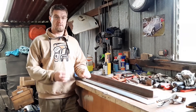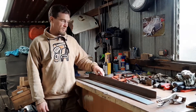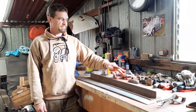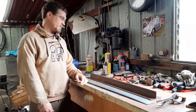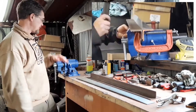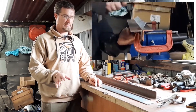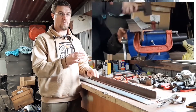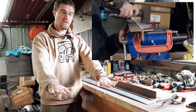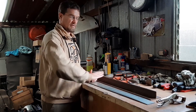So how do you go about bending long sections of sheet steel when you don't have a brake press? The method I use is a couple of bits of angle iron — 6mm thick, 50mm wide — and some G-clamps. You just put your steel in there, line it up as shown, clamp the ends with G-clamps, and clamp the middle in the vice, then hammer it over. Another way that's a little better is to tack weld a thick bit of steel along the top edge of what you're going to bend, which gives you more leverage to push the steel over — though you'll still need to hammer the bend itself to get a nice defined crease.